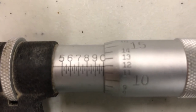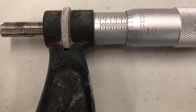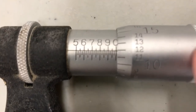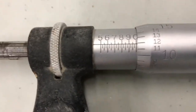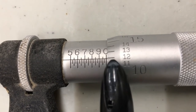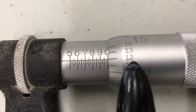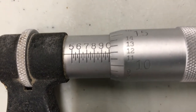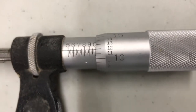The tick marks on the sleeve are 25-thousandths of an inch apart. You see that zero on the sleeve? That zero means six inches. And then you see that 12 on the thimble? The tick mark associated with the 12 lines up with the longitudinal axis of the sleeve. The numbers on the thimble are in terms of thousandths of an inch, so the 12 means 12-thousandths. So we have 6.0 inches plus another 12-thousandths — that's 6.012 inches. That's the zero degree reading at the top of this cylinder.